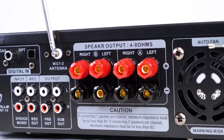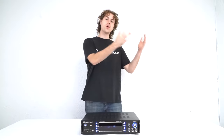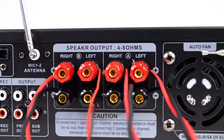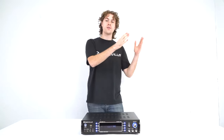There are two channels available to use with this amplifier — one for your left side of speakers and one for your right side of speakers, both 4 ohms stable. There are also two sets of output terminals per channel that are set in parallel. This means you can use either of these output terminals as long as the impedance of your speakers or combination of speakers doesn't fall below 4 ohms per channel.